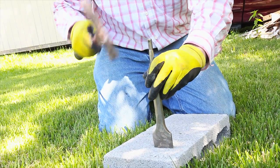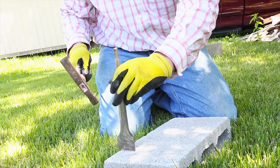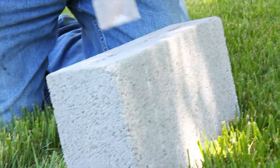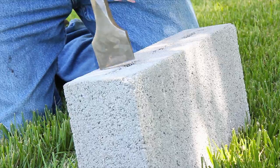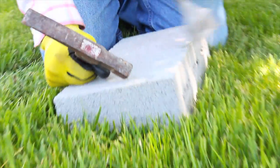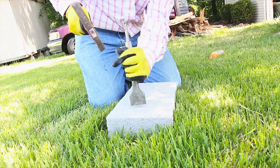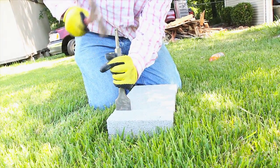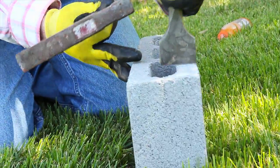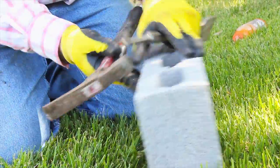It's one little tap or two little taps all along the line that you want to cut. There's my line. I'm going to flip it and just keep working my way around the brick, scoring all the sides. Some of the brick guys who are in a hurry and use this method, they only score the side that's going to show — the pretty side. I like to score them all. I think it saves me time in the long run and I like a better seal.